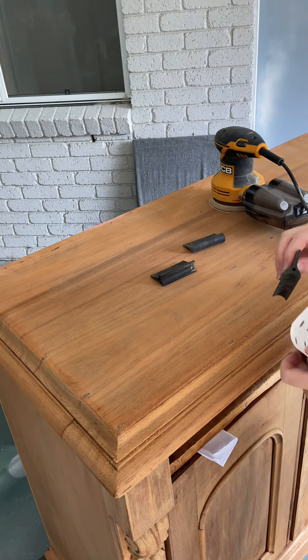After I've made sure all of that finish and stain has been removed and cleaned down the piece from sanding dust, I can now move on to the wood bleaching process. I used a kit called Lightenit, which is non-toxic. However, other brands of two-part wood bleachers will give you similar results. Links to bleach kits are below in the description. Whichever kit you use, be sure to follow the instructions.